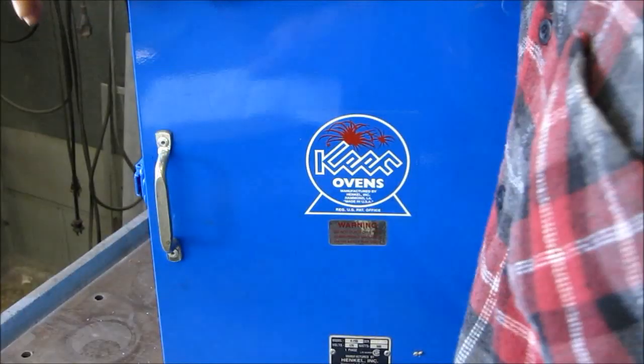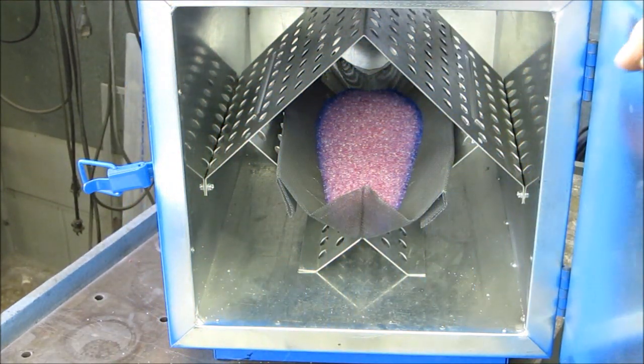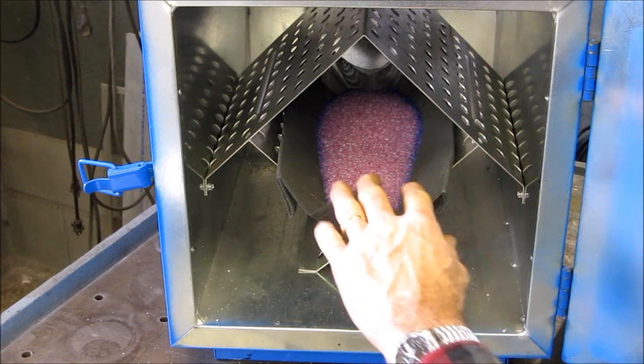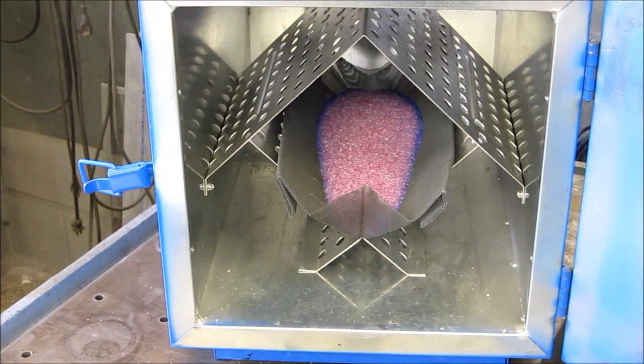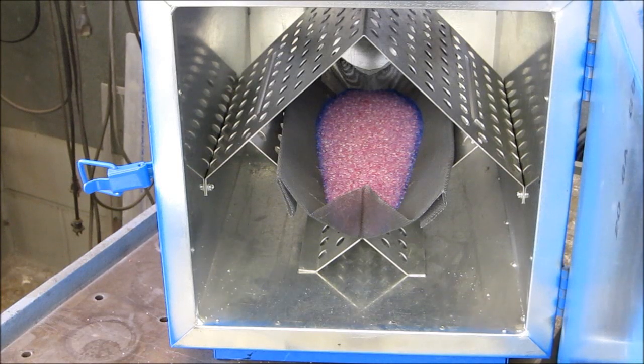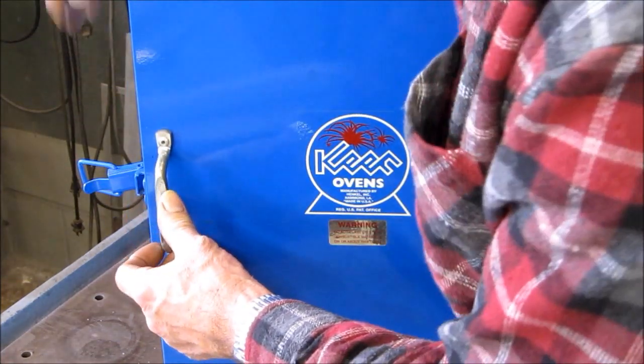We've been in about a half hour now and we're at 220. Opening it up, we're getting a little bit of steam — in fact my glasses are steaming. You can see the blue actually starting to come back right around the edge where it's laying against that screening. It is on its way. I'd rather have it thorough, and I think thorough means a lower temperature. We know it's changing, so we're at least above 212 degrees like the other book stated. We're going to continue for the long haul to get it back down to the original state.